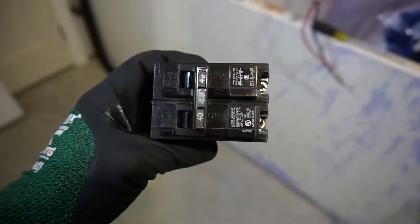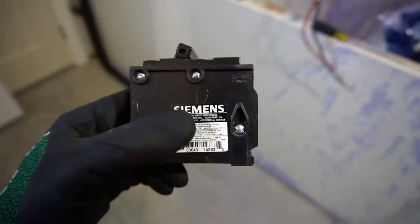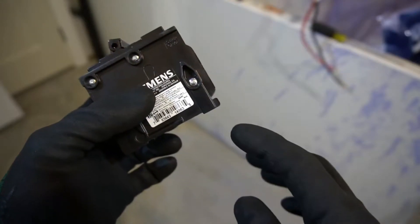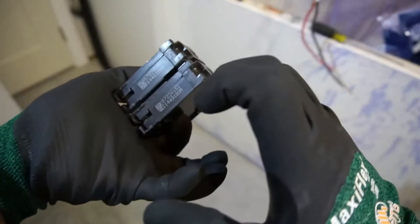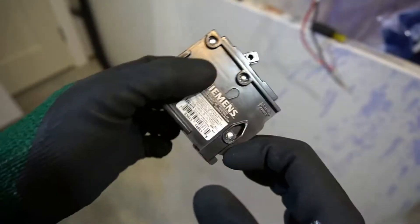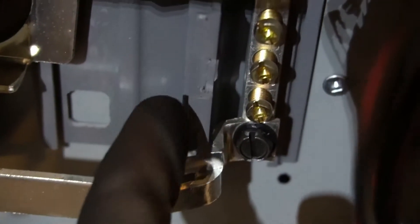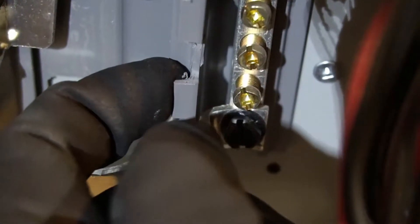Step number three. We are ready to insert the breaker into the panel. But before that, we should inspect the breaker to see how we are going to do that. If you turn it to the side, you see this bottom corner — it sort of looks like a hook. It kind of is like a hook. It acts like a hook where it grabs onto the plastic on the panel. It makes the breaker act as a pivot point where it goes up and down and is able to release the breaker over the panel. This is the part in the panel that acts like a hook against the breaker and pivots it back and forth. This is where you want to hook the breaker under — make sure you get it nice and tight, nice and close into the corner.